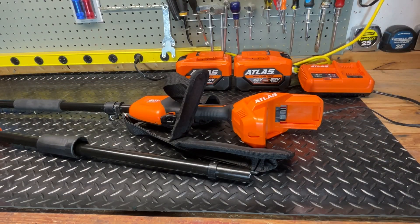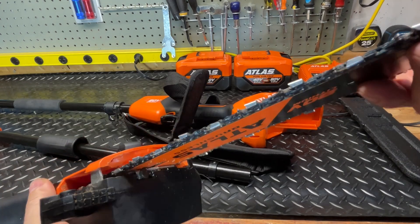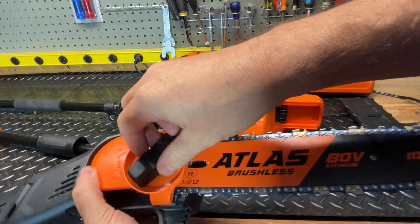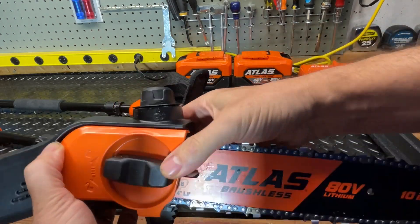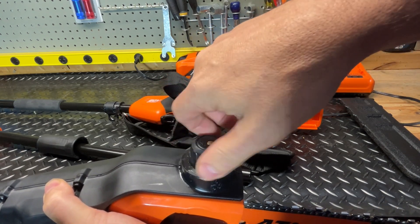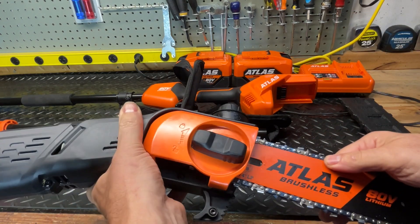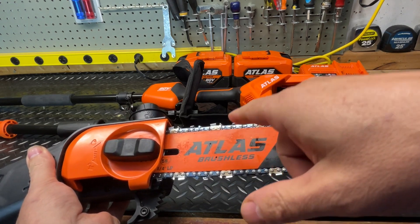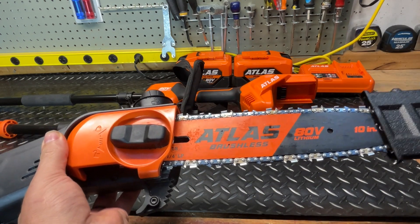There are three parts to this. The head and power section come with a guard. Like all chainsaws, there's a place to tighten or loosen the chain — just turn a screw to lock or loosen it, because the chain stretches a bit with use. It does take bar and chain oil; I just use the Menards brand, which is a big hardware store chain here in the Midwest. Harbor Freight does not sell the chains, so I recommend keeping a spare on hand — I'll put that in the description. It takes the same chain as the Bauer chainsaw.